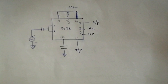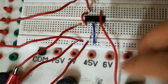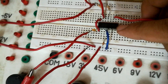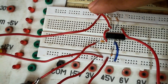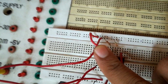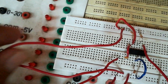Now let's look at the actual connections. All the pins are connected as described. Pin number 2 is the output pin; pin numbers 10 and 11 are grounded, with pin 10 grounded through a capacitor. Pin numbers 4, 5, and 6 — pin 6 connects directly to 12 volts, while pins 4 and 5 connect through resistors to the 12-volt terminal.